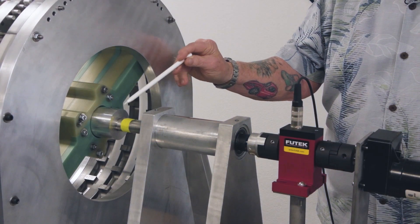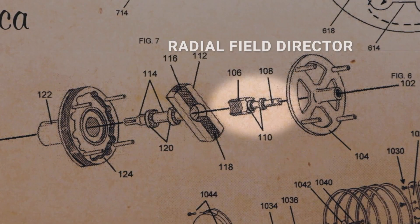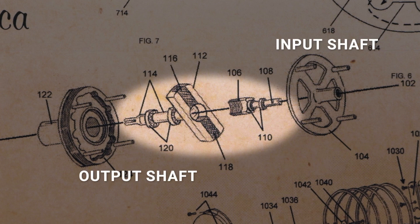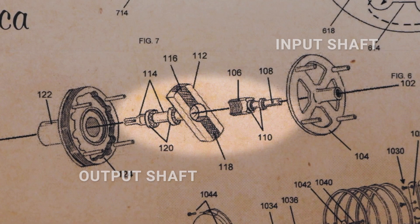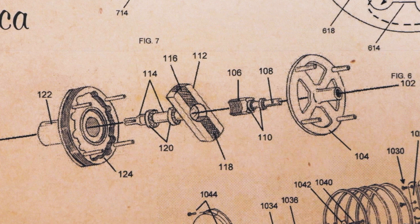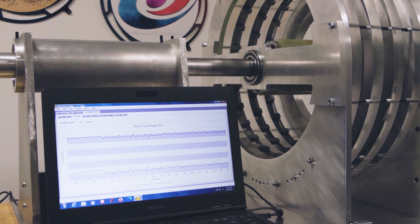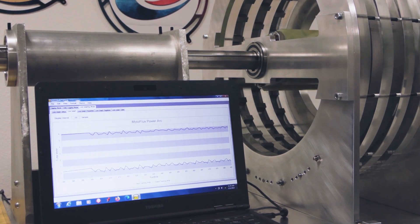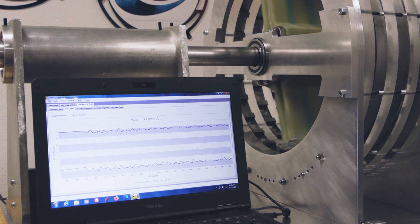This is actually the field director which is being driven by that motor. These two shafts are in line and on a single axis. But the input shaft and the output shaft are not mechanically connected together — they are only connected together with magnetism.